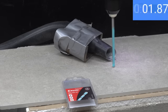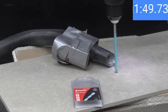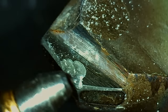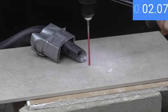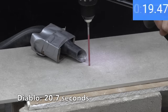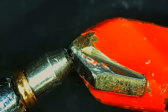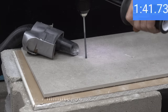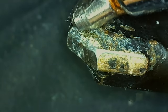The EasyArc successfully completed the first three events and also finished this test at 2 minutes and 28 seconds, still in fairly good shape with some wear and some chipping. Irwin stays in the lead and Ryobi holds second position. Testing the Diablo: it did extremely well on the first three tests and was great on this one too, with the fastest time yet of 20.7 seconds. The Diablo experienced some chipping but still has quite a bit of life left. The Bosch did very well in the first three tests but really struggled with the hardness of porcelain tile, finishing in a minute and 50 seconds. The Bosch experienced quite a bit of wear and chipping.